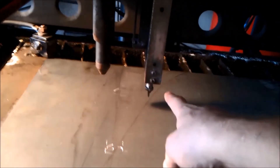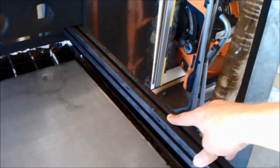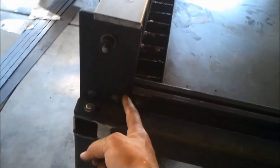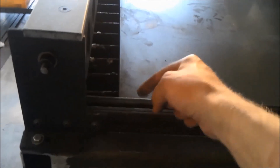As I pointed out before, the way I have my plate marker mounted it's to the right of my plasma. This part will clear just fine, but the plate marker itself will not clear the support you put in for your 2x4 on the original setup. On my table I actually built in places to bolt it in, and that will hold just fine. So what we'll end up doing is cutting off these little wings on either side and taking this section out, so that when my plate marker comes over or the plasma is cutting up to this edge, the plate marker will clear just fine.